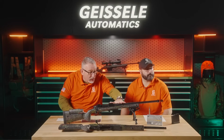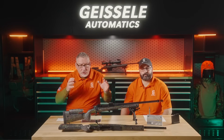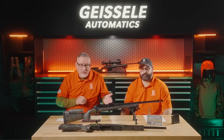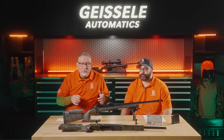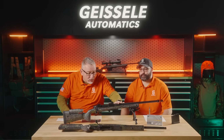You'll notice the contour, comparatively a mid-weight contour. It's not fluted, okay? Doesn't look super space age. I'm on the fence with fluting. I think it adds nothing, all right? If you want a lighter barrel, just make the diameter smaller. It does look cool, I get it, all right? You'll also notice that it's not carbon wrapped. I have not been able to convince myself to go down that route because the carbon wrap barrels that I have shot are basically good for 3 shots before the groups start opening up due to heat, okay? Maybe we'll get into it one day and try to solve that issue, all right? But this is a mid-weight stainless steel barrel.